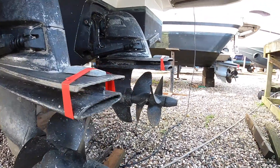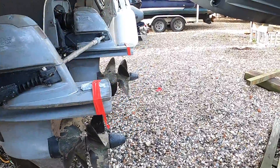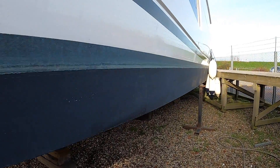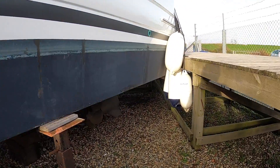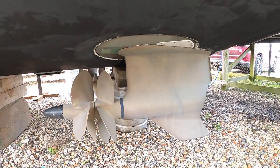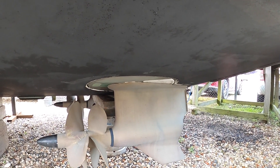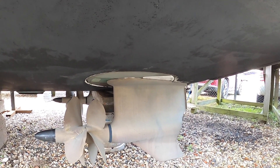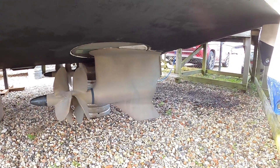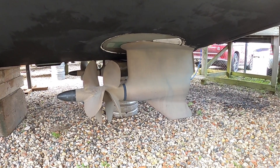Let's go and have a look at IPS. This boat here is a Princess V48 and this is on IPS pod drive. Now these initially look a little bit like outdrives but they're not — these face forward. One limitation of outdrives worth mentioning is horsepower: you used to get up to about 230 horsepower through outdrives, these days up to 440 horsepower on diesels — 440 is about the max. With IPS I think you're up to about a thousand horsepower now that they can put through these.